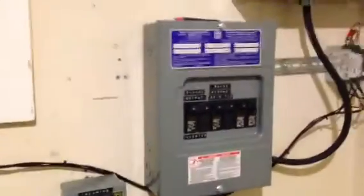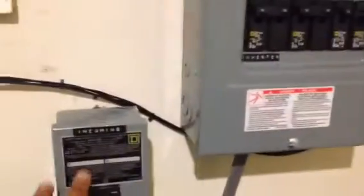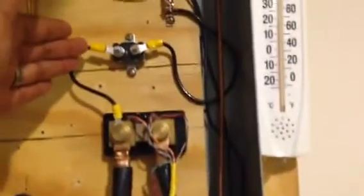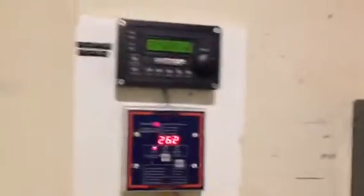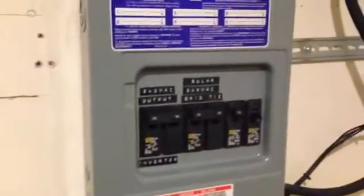The only other thing I'll mention is that there is overcurrent protection throughout the entire system — in the form of these breakers here, incoming and outgoing circuit protection on the battery bank, circuit protection for the voltage monitoring relay with a fuse, and not only that but I have a manual transfer switch whose output is acting as a critical loads panel in my garage, and that also has circuit protection.